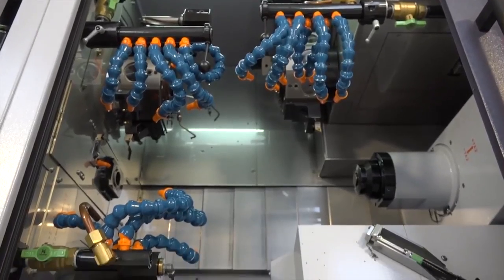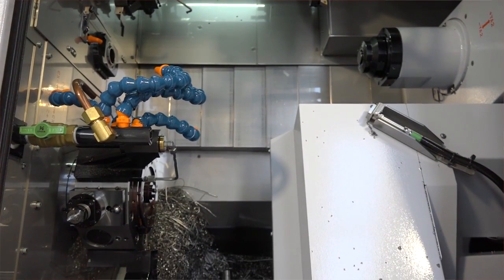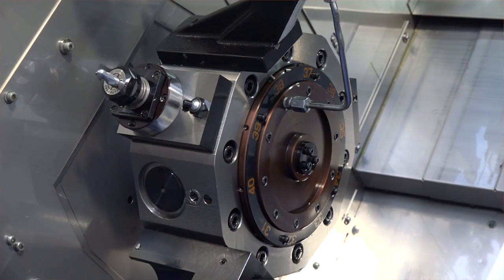What's the largest component? It's over 38mm - you can go above 38mm, so you're starting to encroach on the 52mm, 2-inch bar machines, which puts you in a completely different league. You can see the component they're doing as a demonstration - it just shows you it's far from a typical sliding head. And it's got three turrets. That sets it apart.